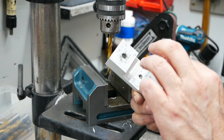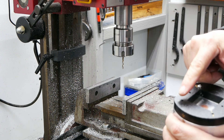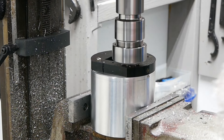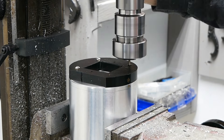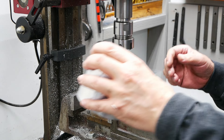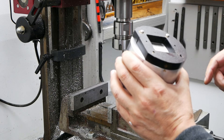Now we're going to mount that plate to the cup holder — I already did two of them and now we're doing the other two. We can drill them in and it's all aligned — looks good. Now we go over to the vise to cut the thread into it. I marked it so I know which way it goes, so if I take it off and put it back on I'll remember the correct orientation.